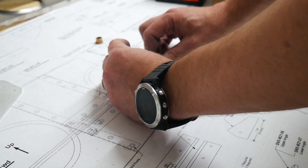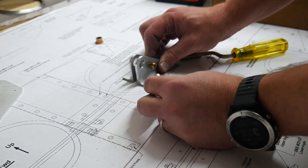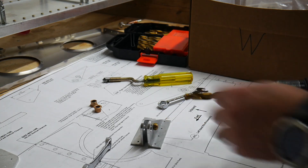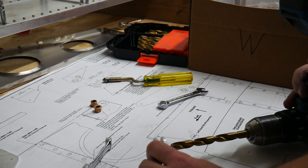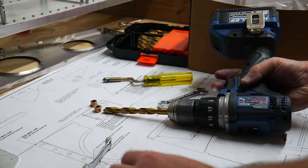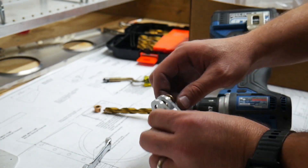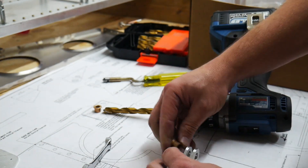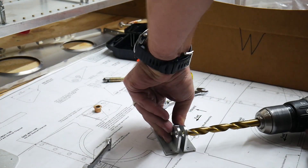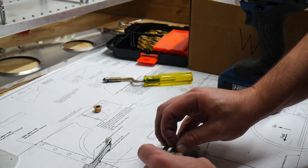The bearings are pretty tight already — I don't want to go too big, but I want to match them up. I drilled all the way through; there shouldn't be any play in there, it should be a press fit. But I don't want to damage anything by forcing it if it's too tight, so I'll clean out the hole a little bit. I have a 7/16-inch drill bit — I'll go through slowly and try not to ream it out too big, just get it to the right size. That seems like a pretty good fit — still a bit tight but it feels pretty good.